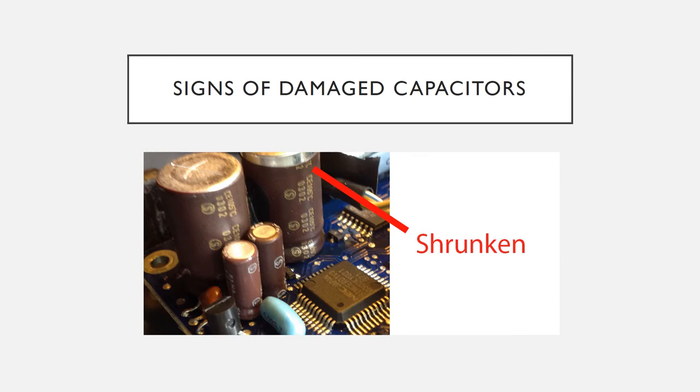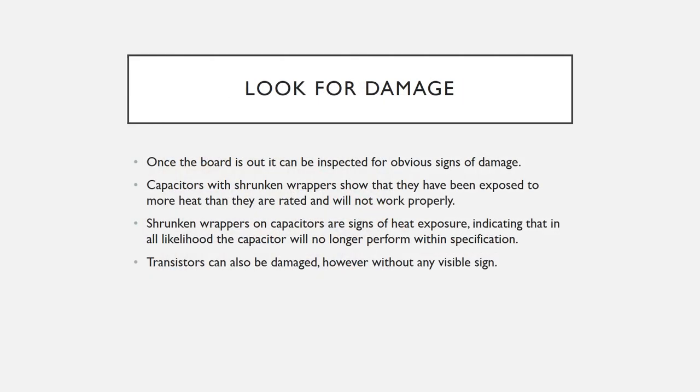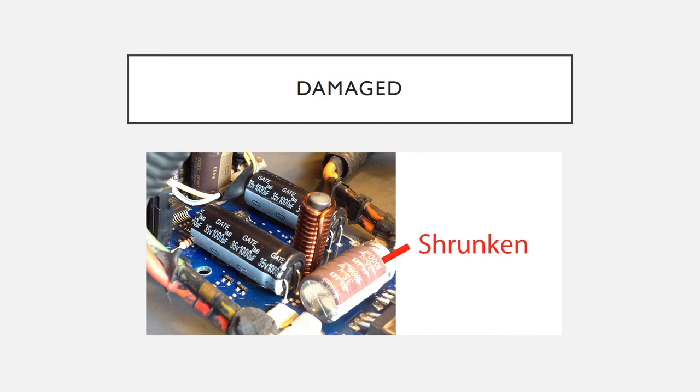The way to see a damaged capacitor is if the wrapper has shrunk, which you can see in this picture. There are seven electrolytic capacitors on this board. I replaced all of them regardless of condition because I did not want to revisit this board once remounted in the car, and they are not that expensive. The wrapper on this capacitor is very much shrunk. I went ahead and changed everything — all seven capacitors — just to make sure.